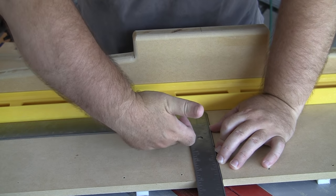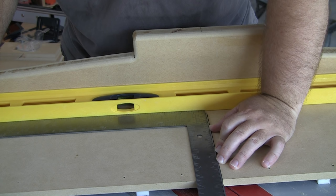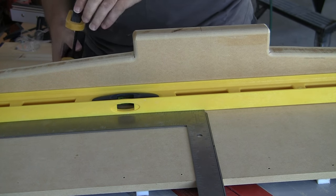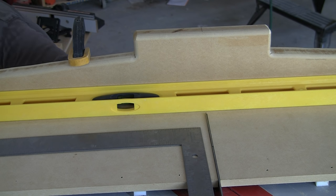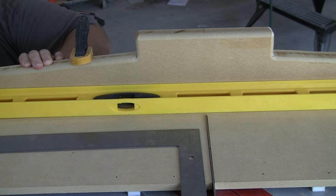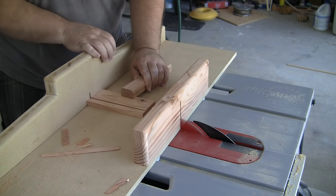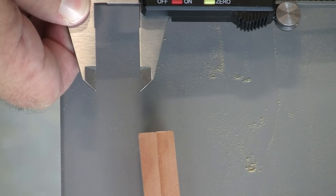Off camera I attach one side of the fence to the sled with a single screw that acts as a pivot point, so I can square up the fence to the blade. I take the straight edge of my combination square and insert it into the cut I made halfway through the sled. Then using my 4-foot level, which I know to be flat, and my framing square, I square the fence as best I can, clamp it down, and insert another screw on the other side to secure it. I've used the 5-cut method to test for square, and when I measure the width of the cut on both sides, I'm dead on using just my framing square — so no adjustments are needed.